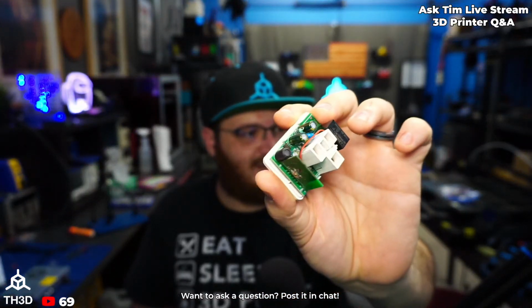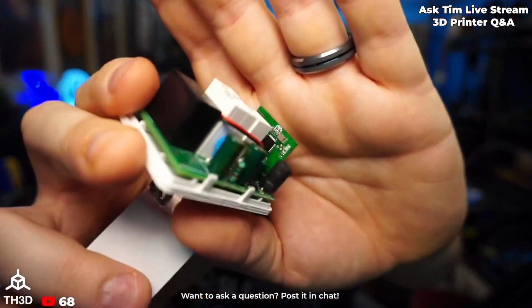I am unplugging my test plug here. All right. Sorry. This is the one I use for testing, and the reason I keep this one around is so I can test the new releases, but also if I have a bad flash. I've opened this one up. I think, yeah, this is one that was sealed. You can get them open, but the problem is you'll probably mar up the surface. This one was one of the first ones, and I told them not to seal them up very well so I could pop them open. But there are TX and RX pins on the little module here.